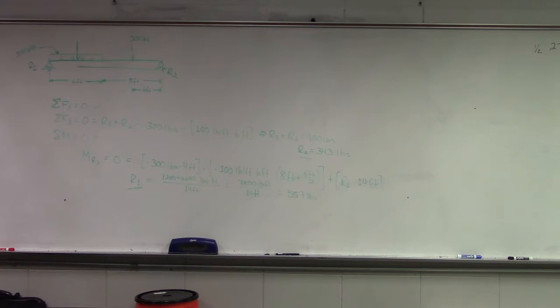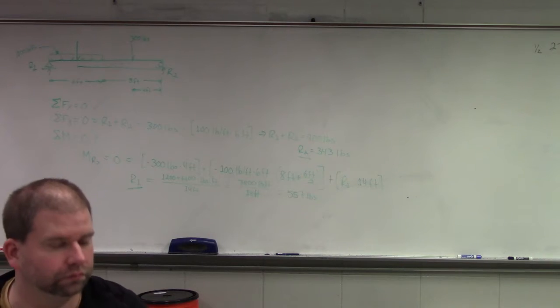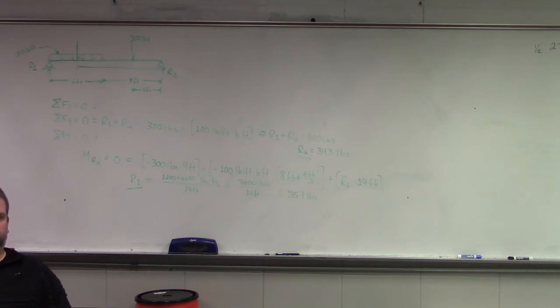That's 1 to 2, so it's fine. But on the height, it's 13 and a half. So you want 2x12s for your roof and floor joists, so it can span the 21 feet with your 8-foot corridor in the middle. Problem done. Well, it's just a preliminary design.